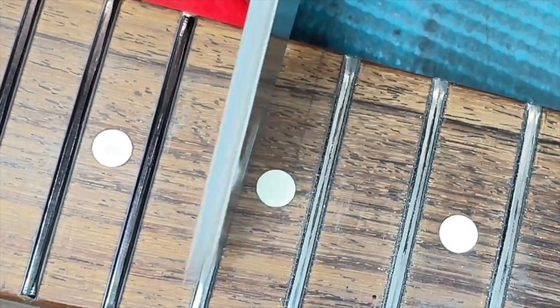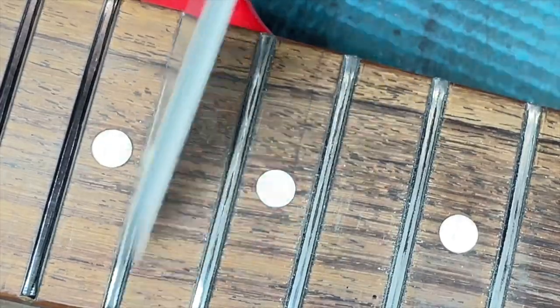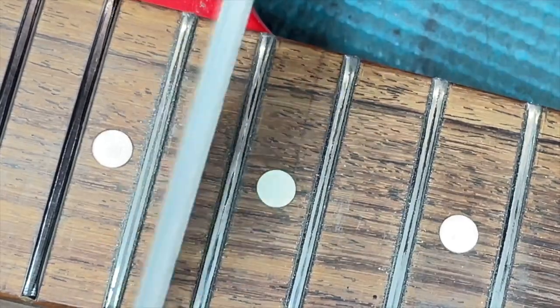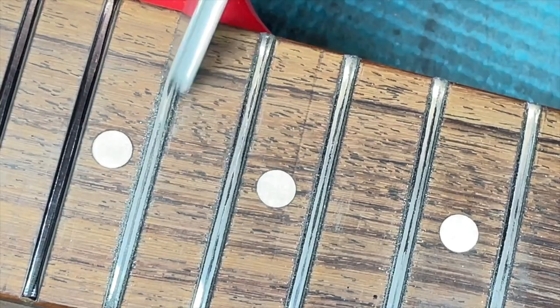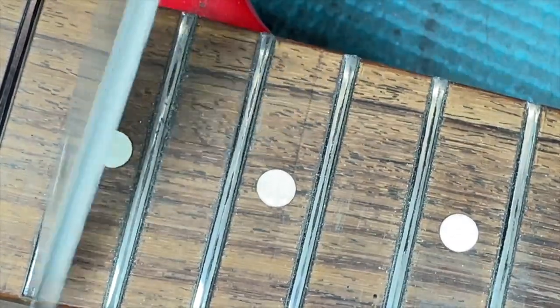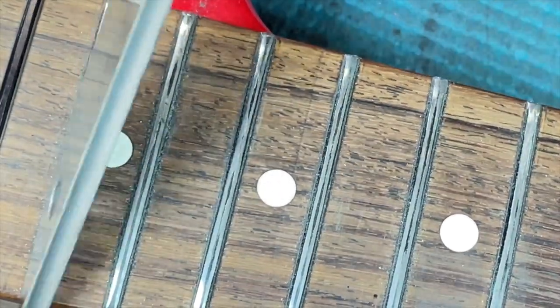And when it bent in a relief curve, which it undoubtedly does, because you need relief in it even if it's made of carbon fiber, it bent in a uniform way, which would have mirrored the curve on the banana had I used it on there. I don't think I had to, because it was perfect, but had I needed to, that neck would have mirrored that curve perfectly well. So we wouldn't have got that whole bunch of some high and some not cutting much and some hardly cutting at all. It would have been consistent all the way through.